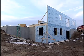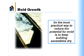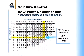A warmer wall means less potential for moisture to reach its dew point, which means less potential for mold. Cold surfaces are what can cause condensation. If you have a warmer outside surface on the wall, you're less likely to have condensation there. As water vapor in the house tries to move toward the outside in cold weather, when it meets a warmer surface, it's less likely to produce condensation. You don't actually have to get liquid condensation to have a moisture problem — mold can happen at high humidities like 70% or 80%.